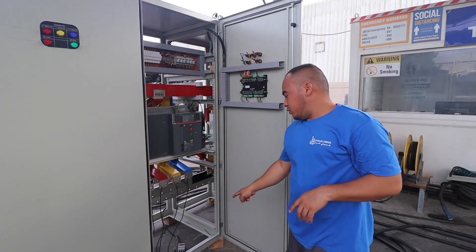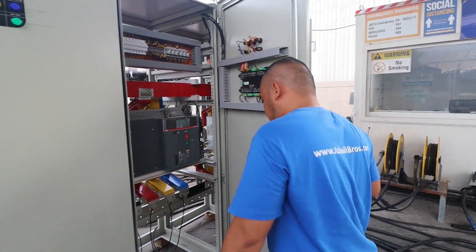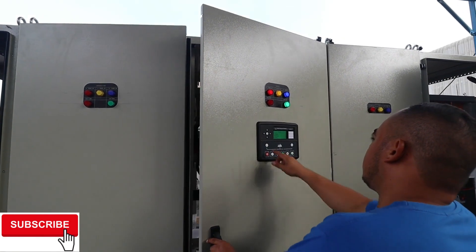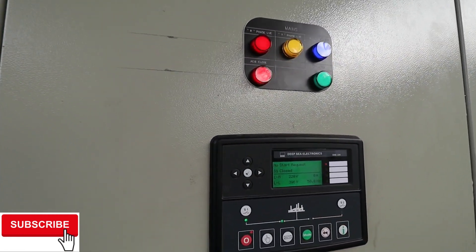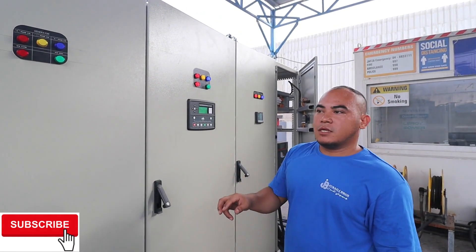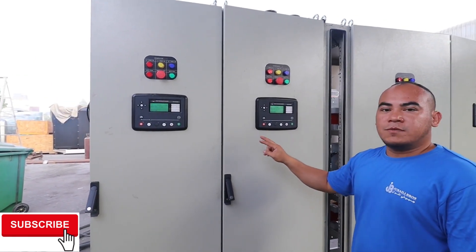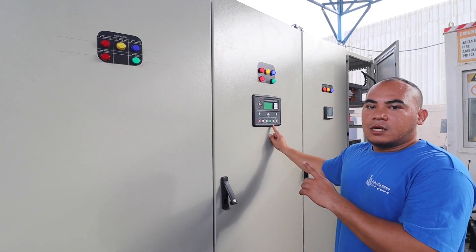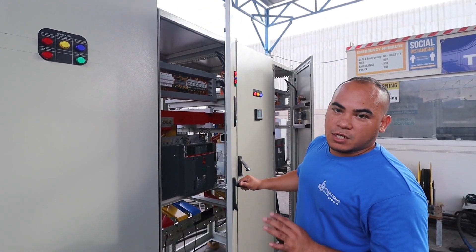Now we're going to put the power supply for the commercial so the breaker will turn on automatically. I will just check the manual. As you can see, the breaker is closed from our ETS one — ETS one is our commercial side. It is closed and we have power supply. Now I will put auto on these things. We will wait — when we command the generator to start, it will sync the two first, then automatically close the breaker, and after that this one syncs automatically, and will automatically put the generator side of our breaker. I will turn off the commercial side in order to activate our automations.